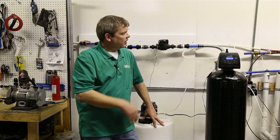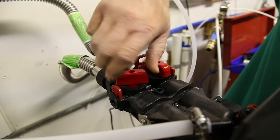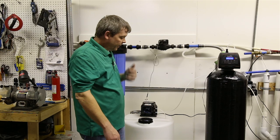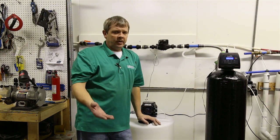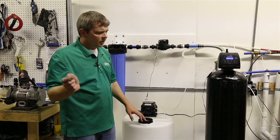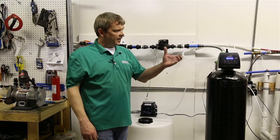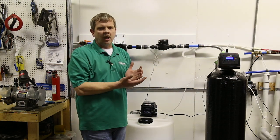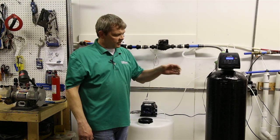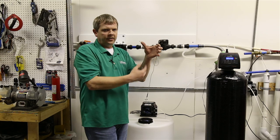When we first have this online and everything's done backwashing, we go ahead and open up our outlet bypass, and then we can go downstream and open up a faucet. As this is running with the faucet open downstream, it's going to be injecting at 100% and putting a lot of peroxide in there. So we want this to inject until, down the line, we get a glass, and we usually want a glass so you can see through it. You take a sample from there and hold it, and it should look like a big Alka-Seltzer full of fizz.